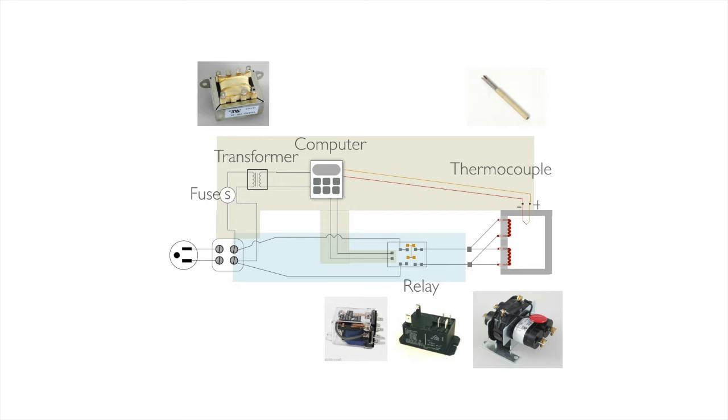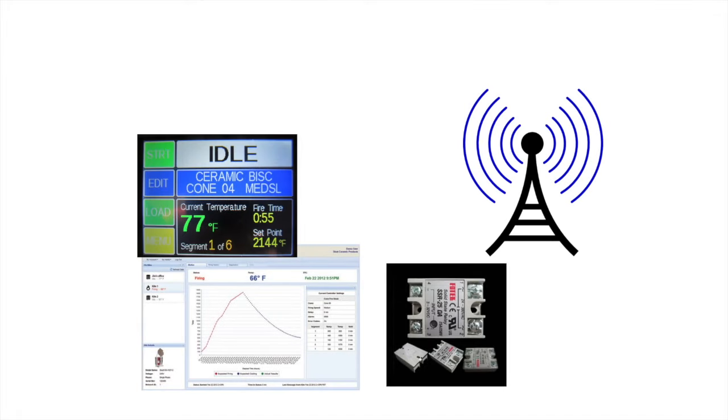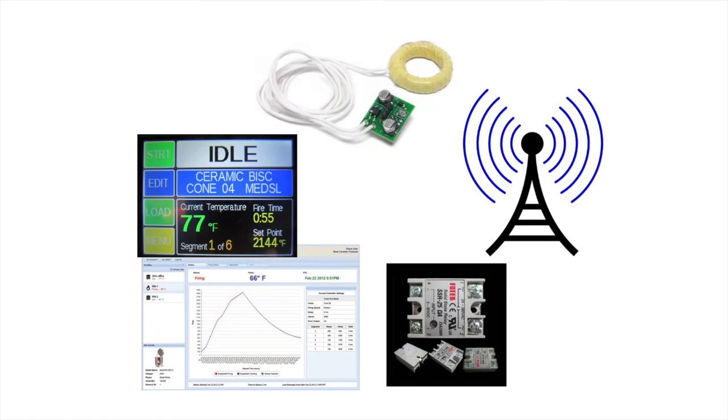And if I put that in the same box that I've got a computer controller in, the computer controller gets too hot. So we have to be careful that we dissipate that heat in order to use them. Some kilns are putting little fins out on the front of that. It's a heat sink. It's literally putting more surface area right on the backside of this thing to allow heat to escape the kiln. I've seen people try to put a fan on the box and blow air up through there, increase that air velocity to cool things down inside the control box. Another company has actually put their control panel, separated it, so my computer's over here, and the rest of the business is over here, so that they can keep them separate from each other. But either way you look at it, solid state relays are a great idea for getting in there.